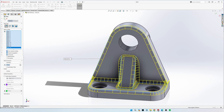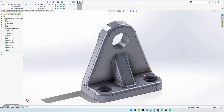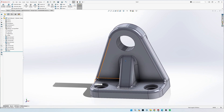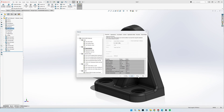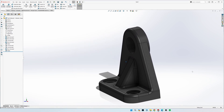Click the green checkmark and give it a look over to make sure everything filleted correctly. The last step is to change the material to Cast Iron - select Gray Cast Iron, click Apply, and that's it for the bracket. Comment below if you have any questions.